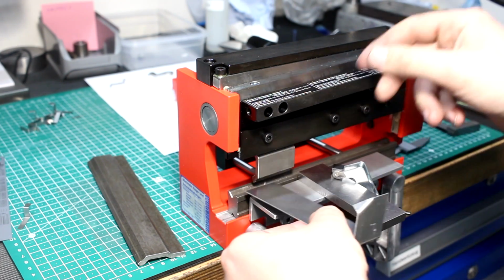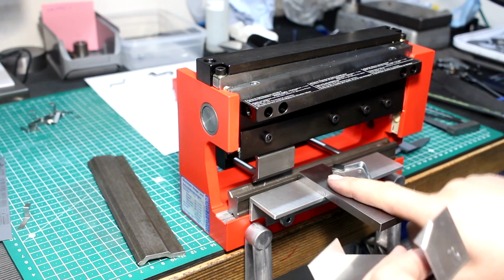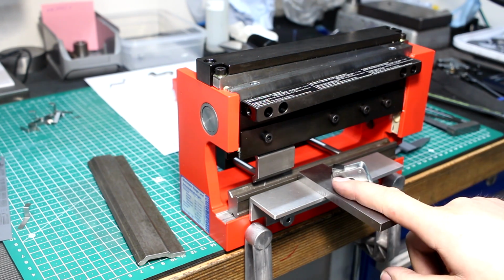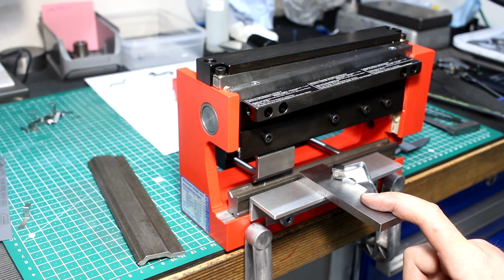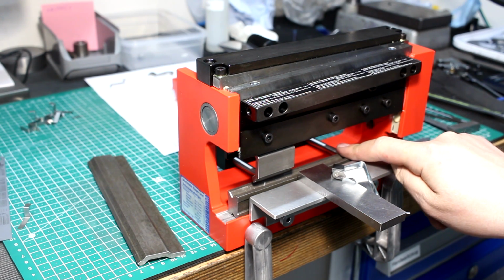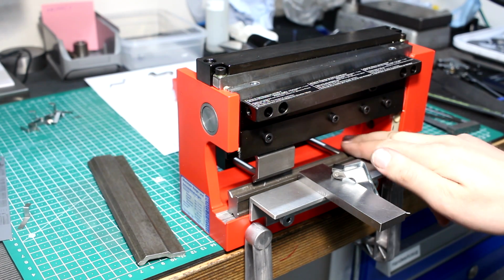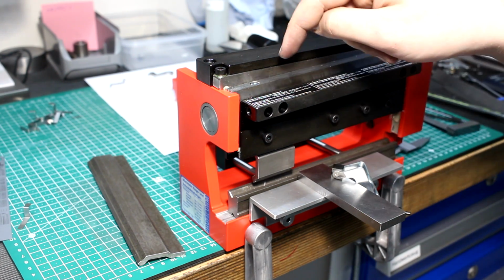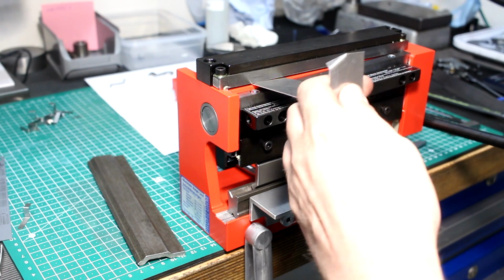And this really allows me to work quite fast, and with cleverly set up stop blocks you can do really a lot. I'm considering adding a dial indicator to the backstop. I have a nice large Mitutoyo digital indicator that I might put on there. And also I want some kind of a stop for the shear. The shear really works nice.